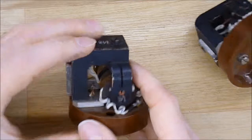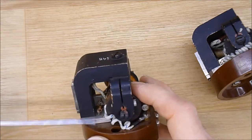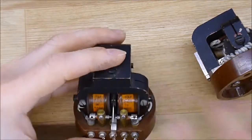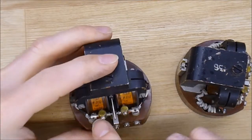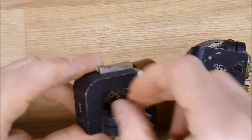We have a pretty solid metal bracket here, but it is not a magnet — it is just steel it seems. It is holding two coils of 4500 ohms each one, and they are mounted in serial, connected in serial with this wire nut here.